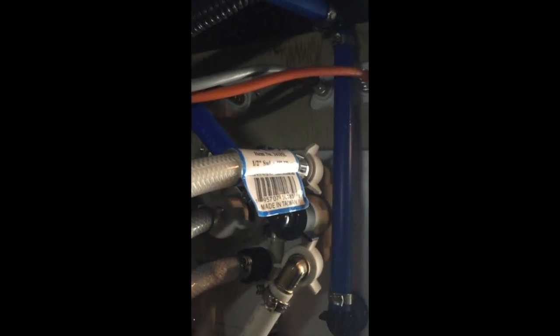Here's the back of the new water panel with everything connected. I made PEX tubing from the input check valve over to this little stud wall to stub in for the connection to the water filter, and then from the water filter, PEX tubing connection that goes over as an input to the valve, to the 4-way.